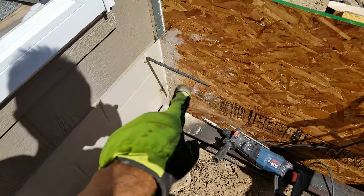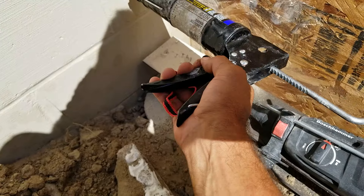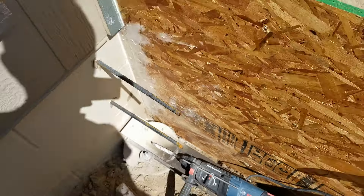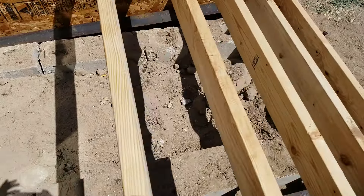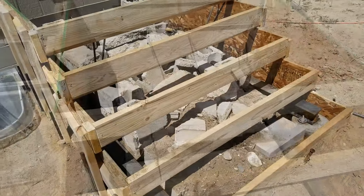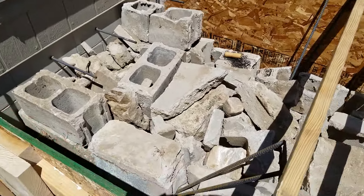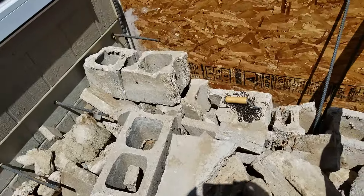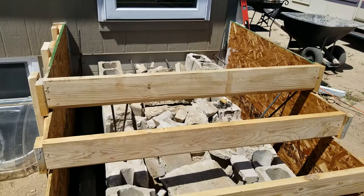Now it's time to add some anchors to the existing foundation that will tie in with the concrete steps. I'm using half-inch rebar cut to 16 inches long — I drill a hole into the foundation about four inches deep, add construction glue to the inside of the hole, then hammer the rebar in place. I repeat this process with a piece of rebar located at about every 16 inches across. The next step is somewhat optional but will cut down on the amount of concrete needed: adding filler to the inside of the step forms. I outlined the edges with blocks, filled the center with dirt, added more blocks and large rocks to the center, and compacted all the dirt with moisture for a solid base. Maintain an eight-inch gap from all edges of the forms so the concrete has good structure with thick walls.